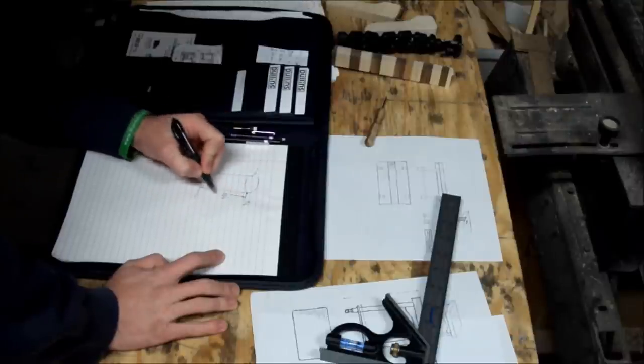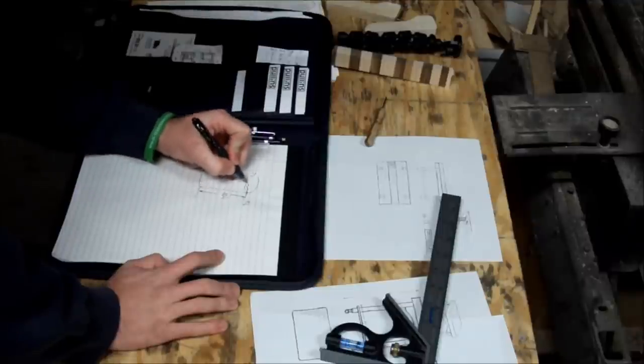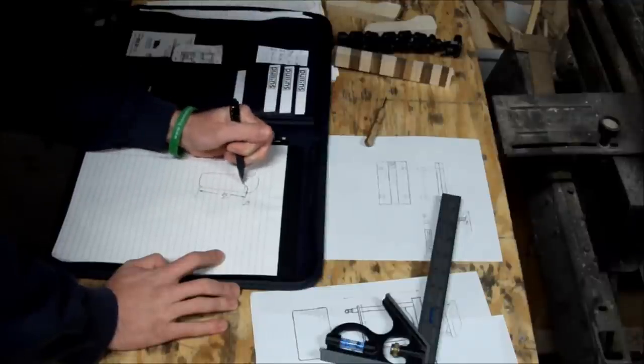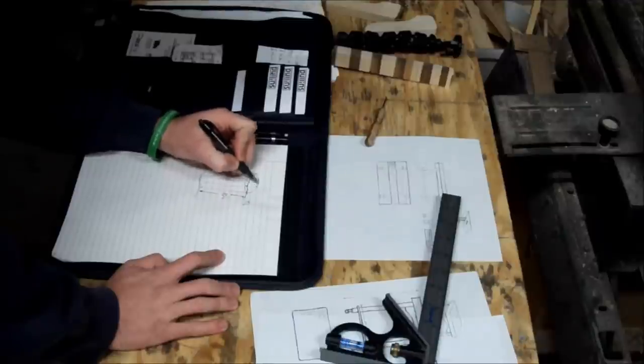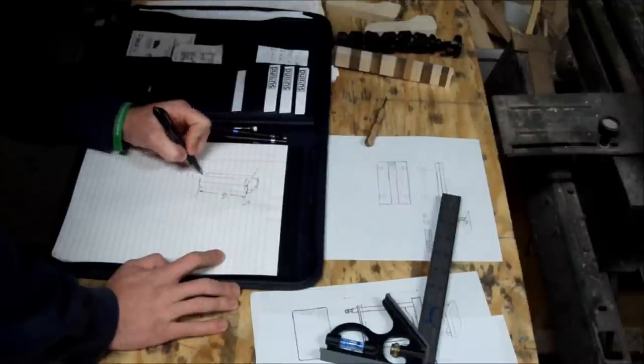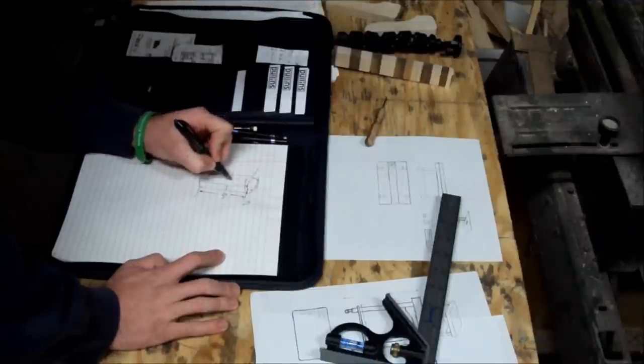I'm drawing the plan for a vessel that has a 4-inch ID and is about 12 inches tall. Each stave will have a width of 1¼ inches at the widest end and 2 15-degree miter cuts on either side. My hope is for about 2 liters of capacity, but I think I'll end up with more.